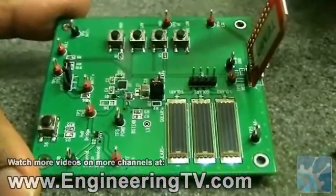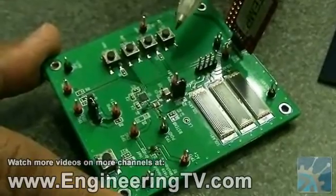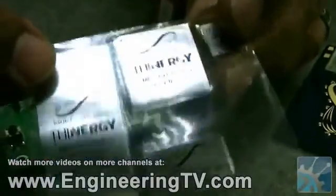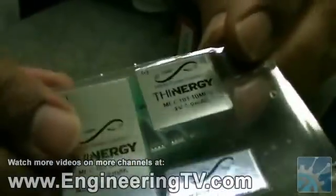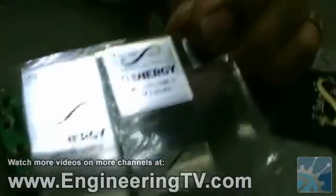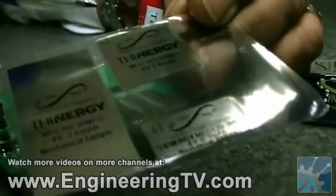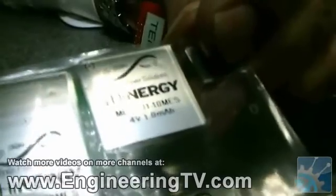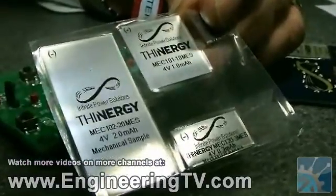This device can take input source voltages as low as 0.8 volts to charge the battery, and it can give you multiple choices of regulated output to run your wireless sensors. Here's an example of an Infinite Power Solutions battery storage cell. These devices are as thin as paper, flexible, and they can store a lot of energy in such a small battery cell. For instance, this particular one is a 1.0 milliamp-hour device that can supply over 30 milliamps peak current. We work closely with Infinite Power Solutions to develop the power management IC to enable the whole energy harvesting solution for low-power applications, from the range of 10 microwatts up to 100 milliwatts.